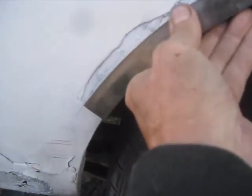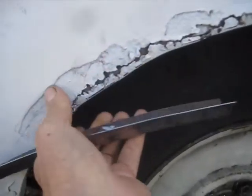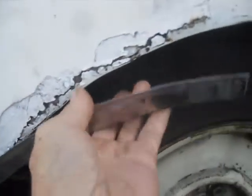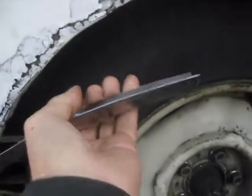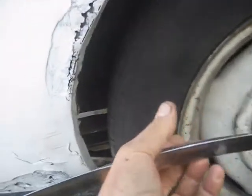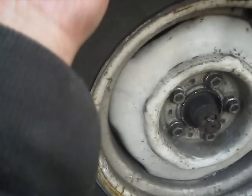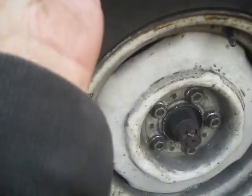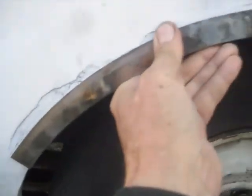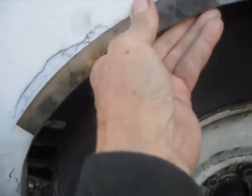I've got a lot of crooked stuff down in here but anyway the curve is good on this piece. Now what I need to do is take off this bondo and stuff here, clean this up, mark this and cut it. Then I'll have to separate these two pieces because I've got an inner fender in there, and I'll weld this piece in. This should fix it - we're still trying to do good sheet metal work here.